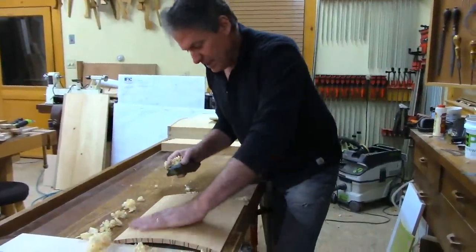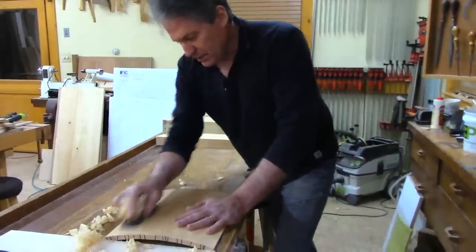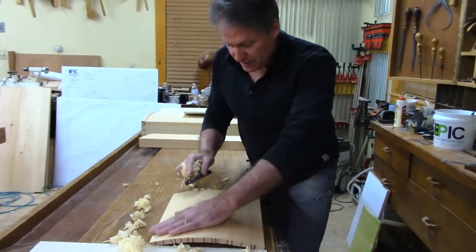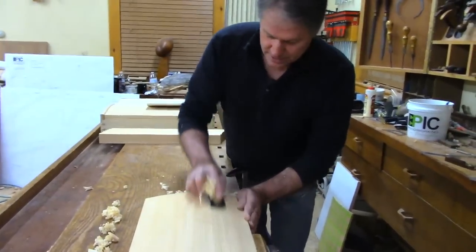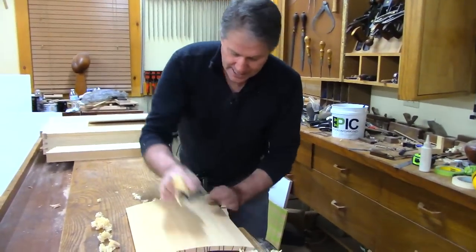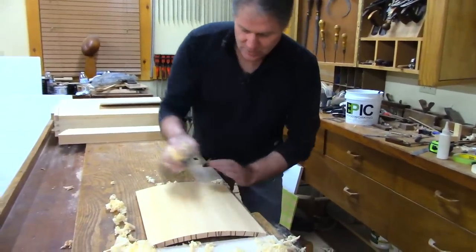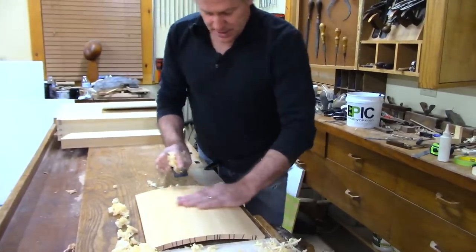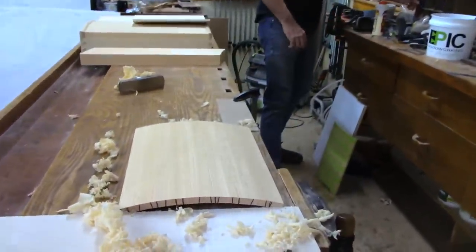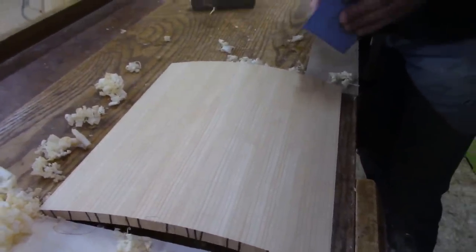It's interesting that a lot of 18th century furniture utilized white pine as the core material for veneering over, like when they were making curved drawer fronts in the Federal period. They would brick-lay up the drawer fronts in white pine, then shape and plane the curve and hammer the veneer right over it because it was so stable. So nice and easy to shape like this. It makes a wonderful substrate, and that was traditionally the choice material for the substrate. So they knew a lot about the stability of white pine then as well.